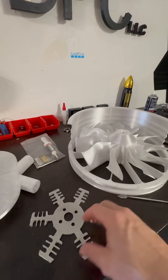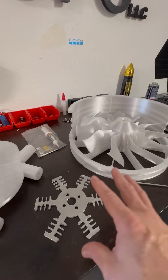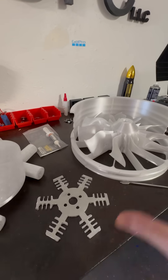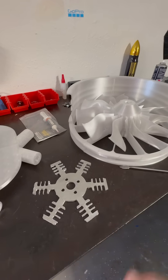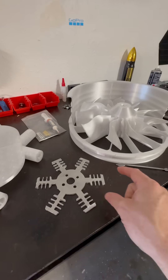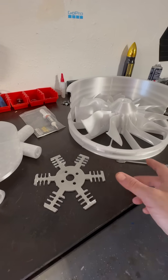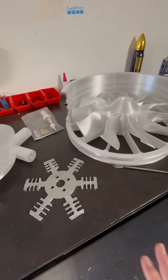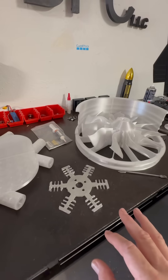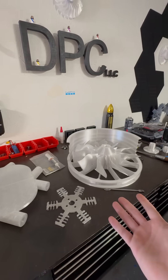It'll all be wired together, going in with the motor's ESC wires and be powered by an individual pack. It doesn't have to be a big one — a small 1850 at 14.8 volts with a step-down modulator, so I can take it from 14.8 to 12 volts depending on the demand of the Peltiers as a whole. They draw three to six amps a piece. That's totally fine. And that is the Peltier cooling system.